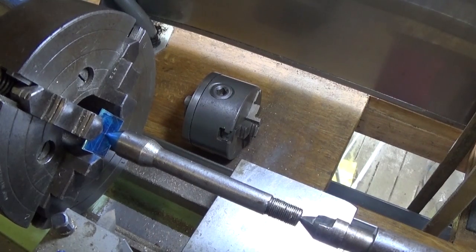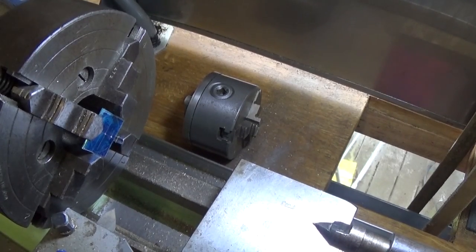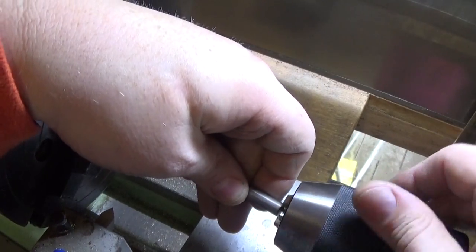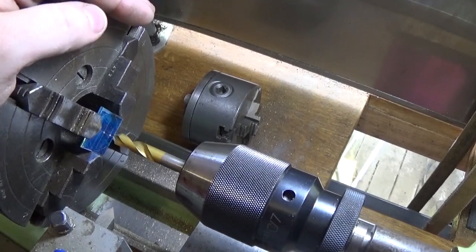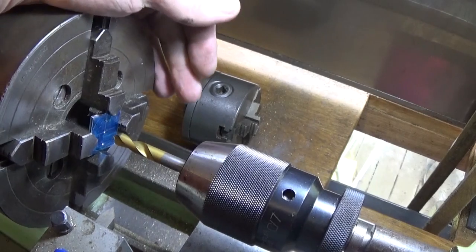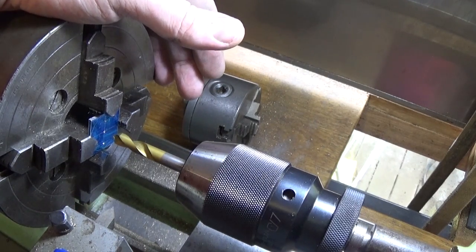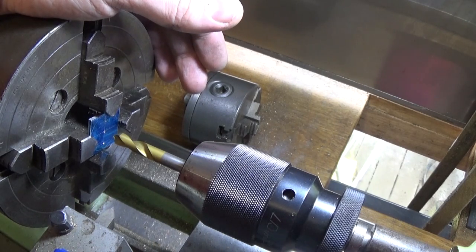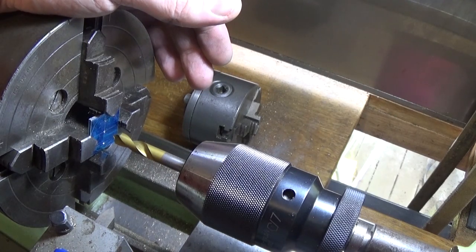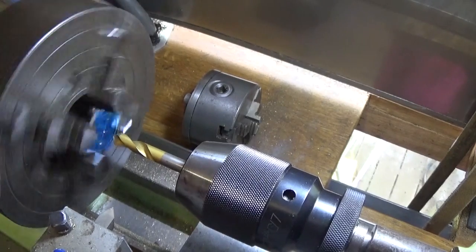Don't rely on two parallels until you've measured them because they don't all tend to be the same size, and some are different one way to another. If you've got a matched pair that's all right, but when you're only using one of them that's pretty straightforward. 90 degree spot drill again. At some point I'll find a nice single point spot drill, and that's what it really needs, but until that happens this is what I'm living with. Watch Stefan Gottswinter's recent video on his amazing channel - he had a good video on spot drills and center drills, single point drills, D-bits and things just recently. Really worth a look, shout out to Stefan. Great guy, jump on his channel and subscribe.